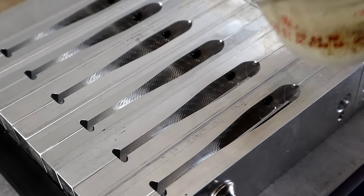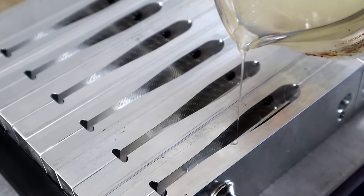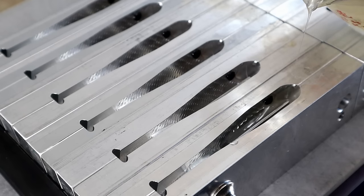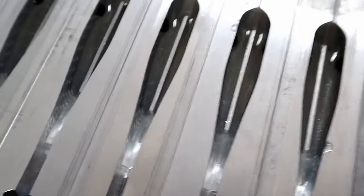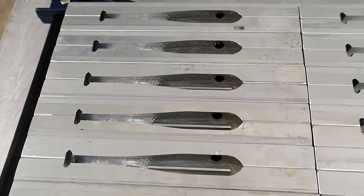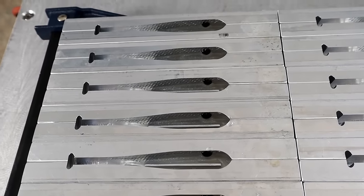I like to start towards the tail of this mold, pour it up to make sure that little fin fills in, then bring it down to the head and fill it to exactly the top of the hook slot insert — not below it, not over it, but exactly to the top. All the bellies are in and looking good. The plastic is still workable — if I blow on it you can see it move — firm enough to pour the next layer but not hardened, so it will still bond and blend beautifully.